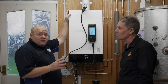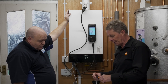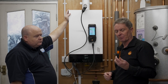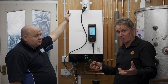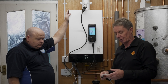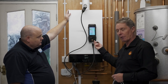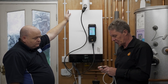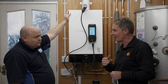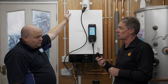There are two ways you can use the Testo 300 for pressure testing. Option one is to use the Testo 510i smart probe, which connects to the 300 via Bluetooth — for example for a burner test in conjunction with combustion testing. For tightness and let-by testing you would use the adapter that comes with the kit. This adapter replaces the flue gas sampling probe pathway so it's for pressure, and you use it with a suitable hose for your tightness and let-by testing.